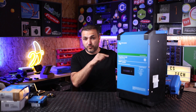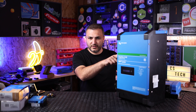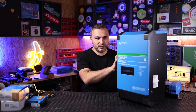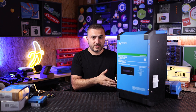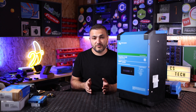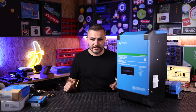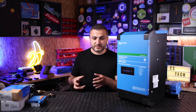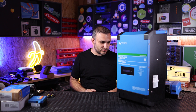Please keep in mind, it's a full-size MPPT inside here. I will make a 'what's inside' video next. It's a full MPPT, and it depends on the inverter capacity — there are two versions of MPPT: 250 volts by 70 amps, or 100 amps. That 70 and that 100 represent the amps that are drawn from the solar module and put into the battery.